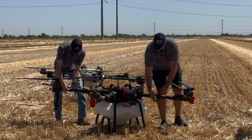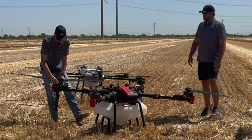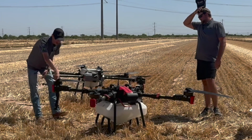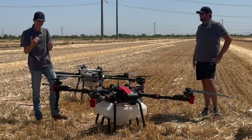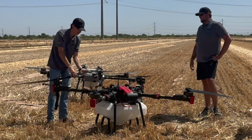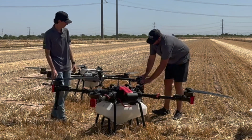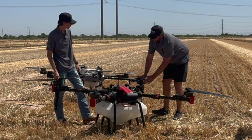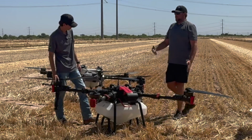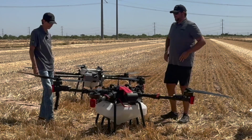So we're running down the arms. We've checked, like Brett was talking about, these are where we connect when we pull the arms in. And then again, running down to the motor. Put your hands on the motor. Don't be afraid to touch your drone and make sure, okay, there's no cracks here. It's freely turning. There's not any kickback. It's not hitting things as it's spinning. And running your hands down the blades too to make sure there's no cracks, frays, or damage that's going to affect the flight conditions. And doing a spin on this motor too to make sure there's no grittiness or graininess in that turn. Even giving it a little shake side to side here to make sure, you know, there's no bearings internally going out. Anything that's going to cause more heat, take more power, potentially cause an accident.